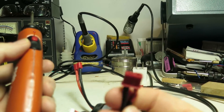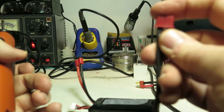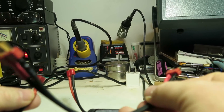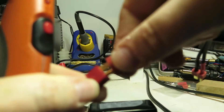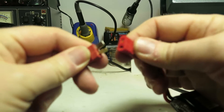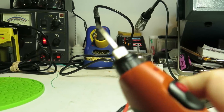I put a female connector going into the soldering iron because I didn't want it to short — if I had a male connector on here it could be a potential for short circuit if I was also running USB. So I made this bridge wire adapter with two male connectors. I'll just put this in here and connect them.